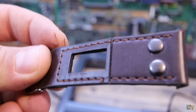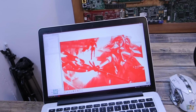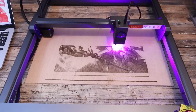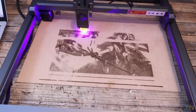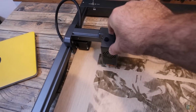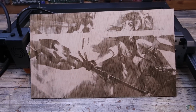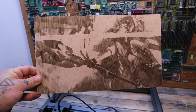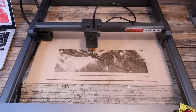So what can this engraver do? I've tried to engrave a big picture with LaserGRBL. It was all going very well, but as you can see, at some point the cable from the laser got disconnected, and I had to plug it back. I have to place the wire better, so it won't get hung on the frame. But without paying attention to that error, the design turned out okay in around 55 minutes. And this is a big design, and I went at only 5000 mm per minute.